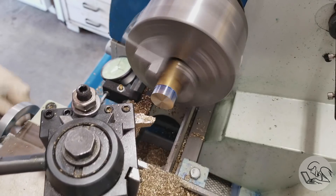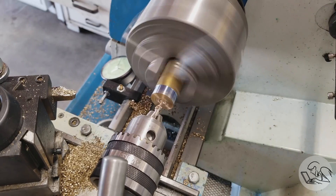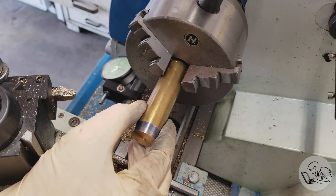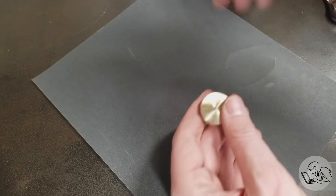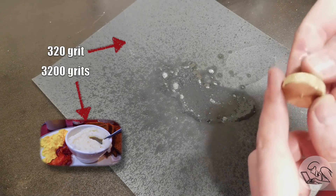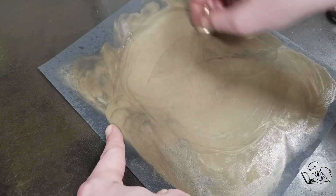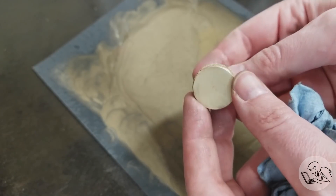Now we'll go ahead and make the second one — that's why we cut enough stock for two parts. It's time to make the second knob: face the end off, punch a new center in it, pull the bar out, and carry on making another part. Anytime the stock is small enough diameter to fit through your spindle bore, you can make all your parts in a row like this — it's very efficient. Modern CNC lathes have an automated way of doing this called a bar feeder, but here in the hobby manual shop we are a human bar feeder. We just have that little nubbin to remove that the parting blade left — some WD-40 on emery paper makes quick work of it. Move it in a figure-eight pattern to keep from getting crooked, and with brass this is very fast.